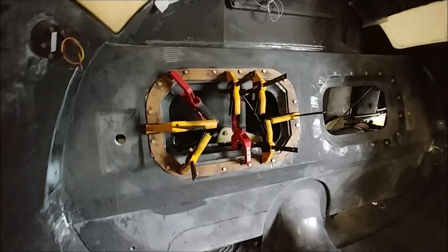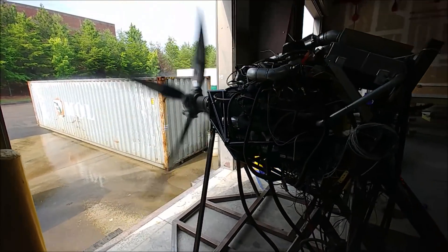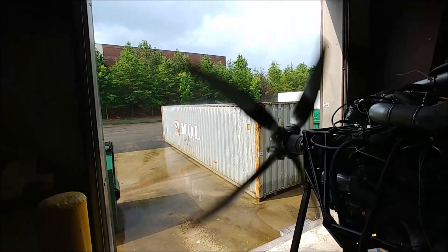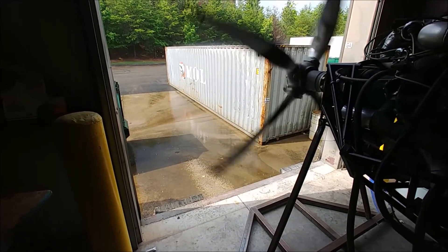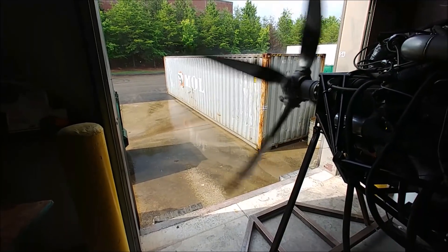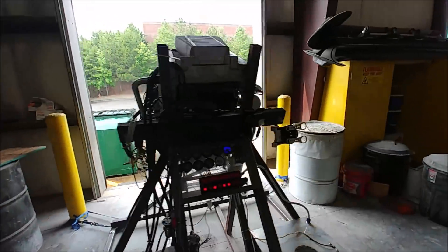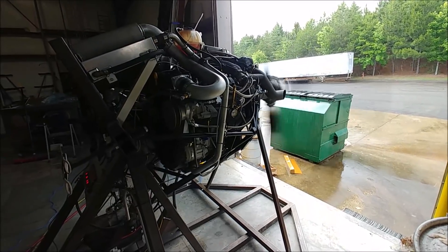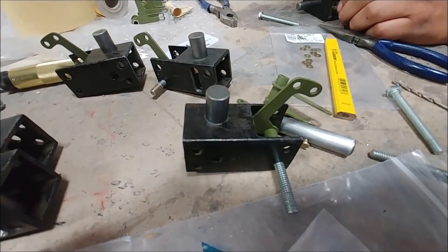There's the one on the other side that was done the previous day. I got to run the engine just real quick — I wanted to see it was running well after putting that new scavenger thing into the exhaust. It was running a little rough and I couldn't figure out exactly why. I figured it out the next day: the connector for injector number three wasn't pushed all the way in, so it wasn't firing. That's all sorted out now.